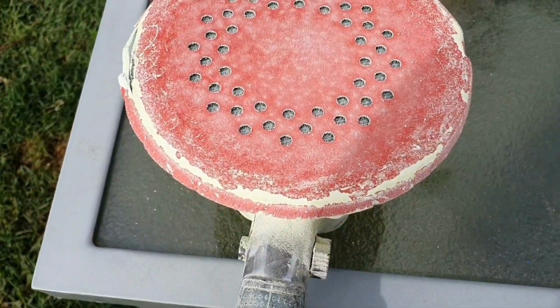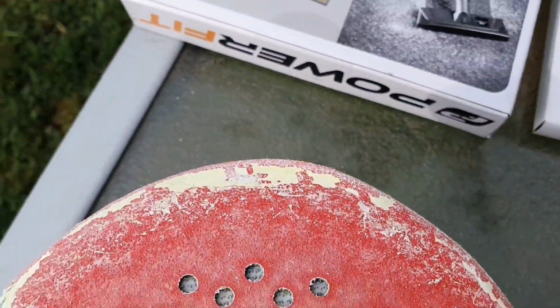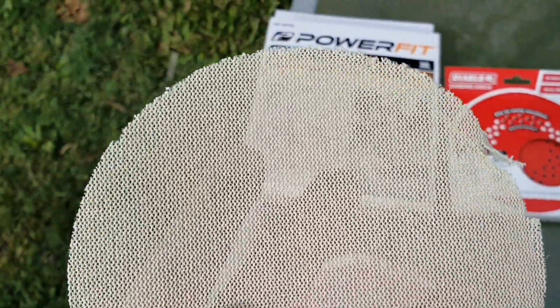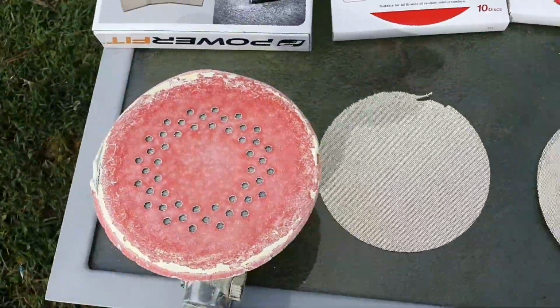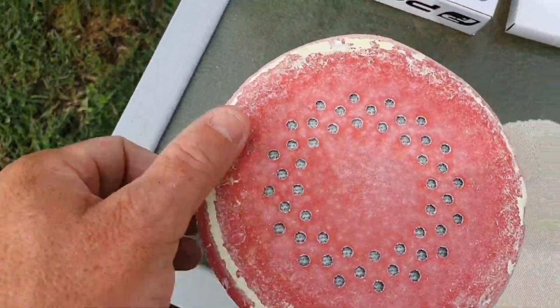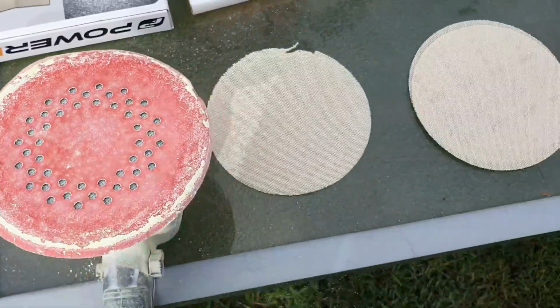So that's what I was saying about them pads. I use the edges a lot getting into the grooves of the boat, and these ones, if you do that, the edges just chip away and they become pretty bad, to be honest. I thought they'd be good for the flat spots, the side of the boat, but any sort of ribs and that, where I'm trying to not hand sand, these are definitely the winners. Just tidy up.